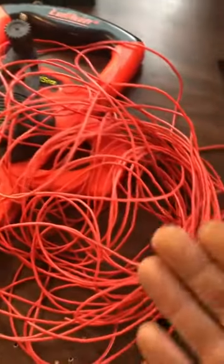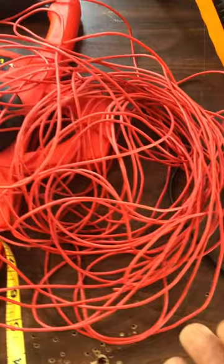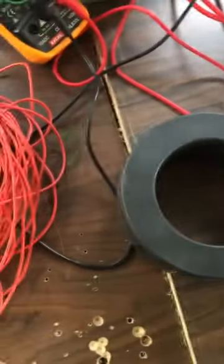Next I'll cut that in half and the length of that will be 346 inches, which is like 27 feet or something like that — a side. That's half wave. Once I've cut that and wound this, this will get all wound the same direction, both windings in the same direction. Because if you go opposite directions, you're going to start neutralizing the magnetic field — and you don't really want to do that. All the same direction, because we want this to flow around the core in both directions.